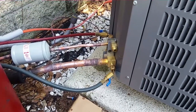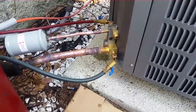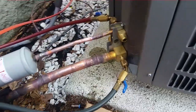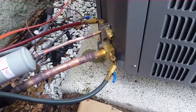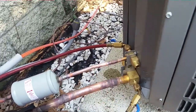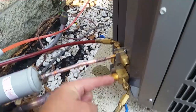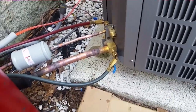The service valves on this cube unit are kind of strange. I think Steve and them were talking about it — it's one of those things where you can't really get the valve core remover on it. It's a little odd; it would be nice if they were sticking out a little bit farther, or in a different orientation — diagonal or something like that would work. But that's neither here nor there.